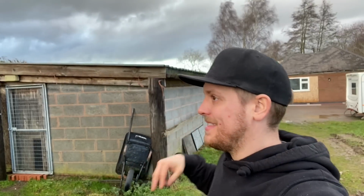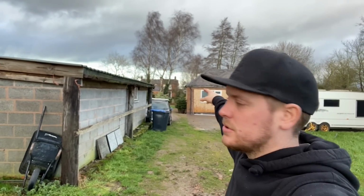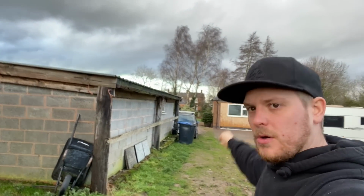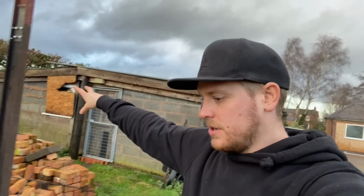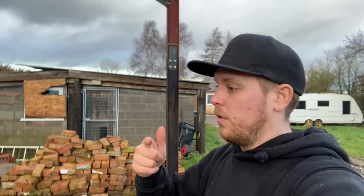I've got my friend Leon coming over with his digger the end of the month, 27, 28, and he's going to dig us a trench from round the side of the house to get the electrical feed. Across the front of the house we'll pick up water, and where the waste's going to go, we're going to come all the way up here, 90 it round there, and into where the toilet is going to go, over in that corner. So yeah, we're going to have proper waste, a proper water feed, and we'll have electricity to it as well.